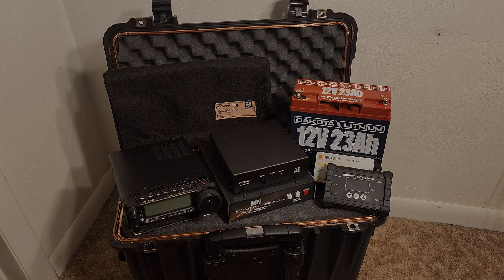Now there are two direct threats to your radio. First is the radiated energy that flows through the air. This radiated energy couples very efficiently into long conductors such as your transmission lines, cable and telephone lines, as well as amateur radio antennas. Basically the shorter the conductor, the less efficiently it couples, but many of us in the amateur radio community have long antenna wires — a beverage antenna, a random wire — and this will easily transmit through those wires and damage our radios. Many modern transceivers have very sensitive receive circuits that would easily be fried if connected to an antenna during a high altitude electromagnetic pulse or coronal mass ejection.